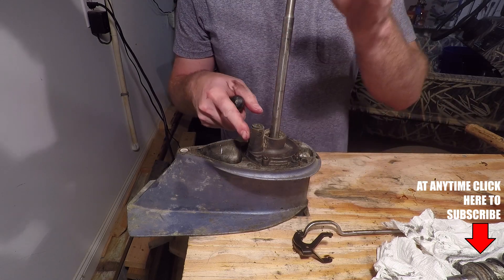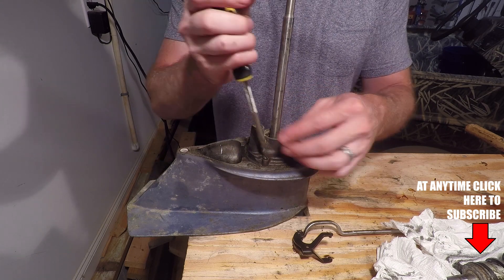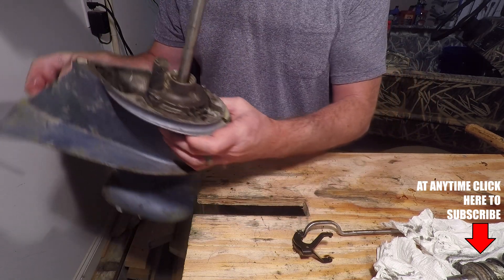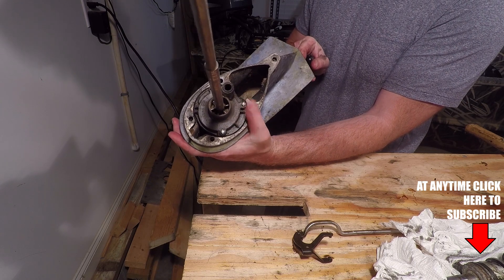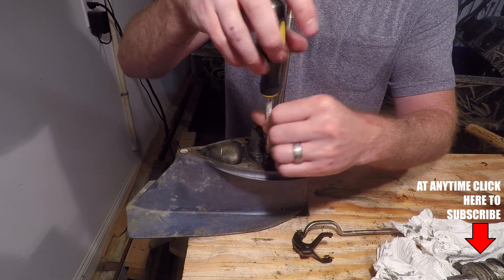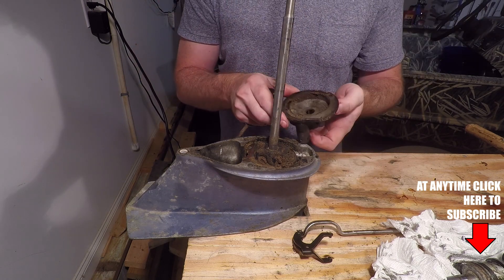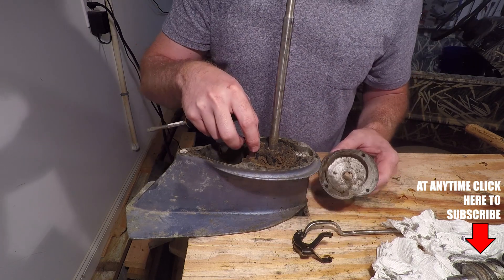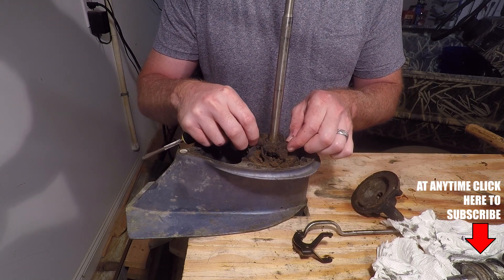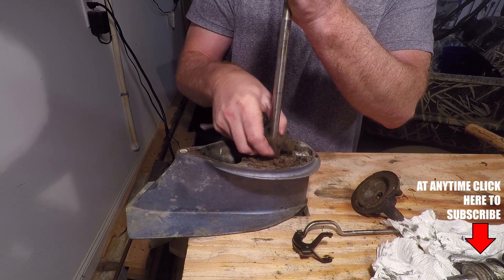On the top side we have our drive shaft and our impeller housing. To take off the impeller housing there are three screws — one here, one there, and one there. Remove those three screws and the impeller housing should slide right off. You can see that this is in really bad condition — the impeller has a bunch of trash in it. The impeller should just slide right up and off.